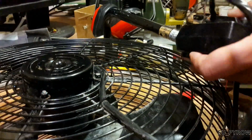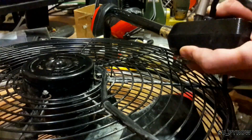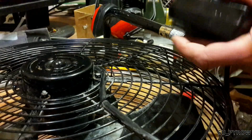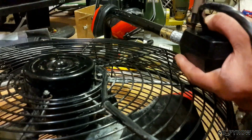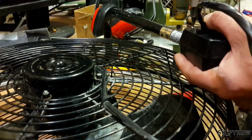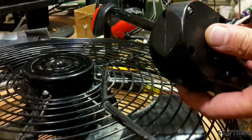Never do that. The only time you use something ungrounded is if it's intentionally ungrounded so you can do measurements on it. You use an insulator for that. You use an isolation transformer. It's the only time you shouldn't have a ground connected and have it floating. It's just too dangerous.